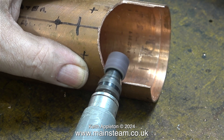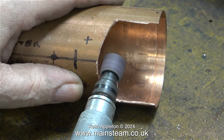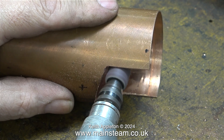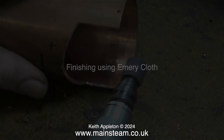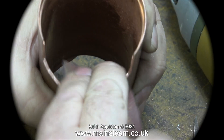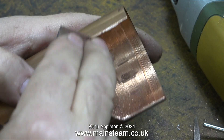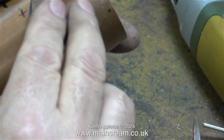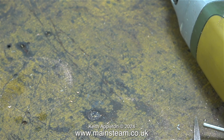As you can see, the Dremel drum is removing more metal at every pass without destroying itself and it's very easy to control — because even at this stage, if I slip onto the outer part of the barrel I have a problem. Finishing was done using emery cloth. You can't beat this stuff for a fine finish and the control is good, although I did slightly scratch the outer part of the barrel with it. Thankfully that is not a problem as it will polish out.